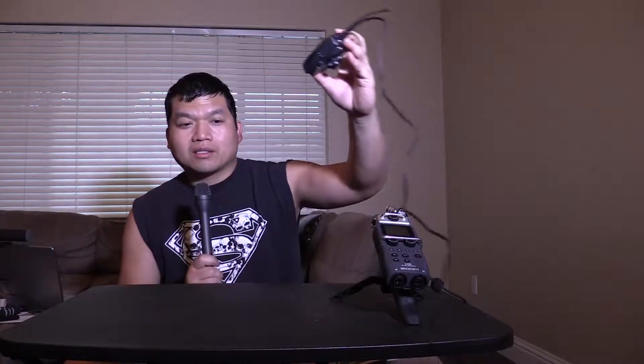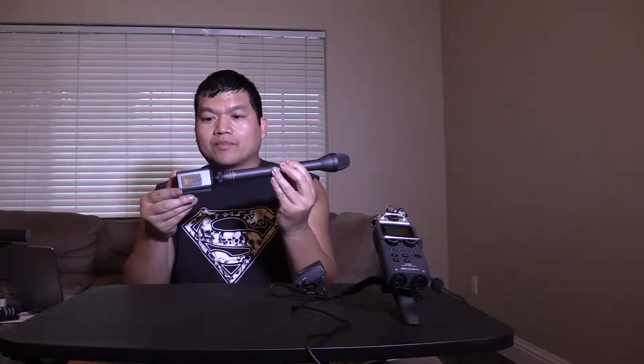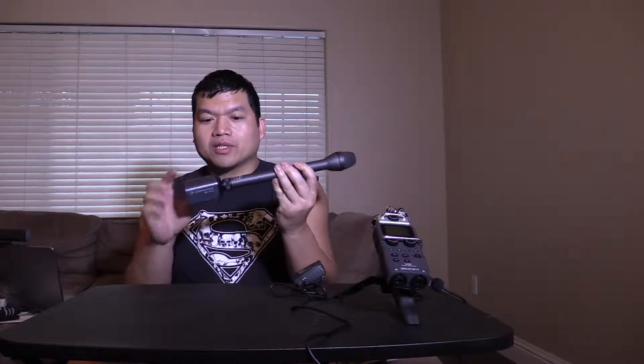Now I'm on my Rode Reporter here. I'm just using a long aux cable right here — a regular aux cable to hook up to my camera's input. I'm not using the XLR input. Right now the Rode Reporter is about chest height. You can see the transmitter right here — it's hooked on, securely tightened. I can see the gain from my LCD screen. It's pretty good, it's peaking sometimes. So this is chest height, talking in my normal voice.